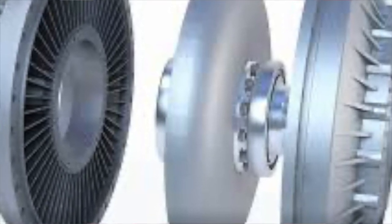And then what happens is as the motor picks up, the two halves turn independently of each other internally. As the motor picks up its RPM, those fingers try to take that fluid and sling it to the outside. Well, the channels get bigger to the outside as they go because they're shaped like a pie. So they get bigger to the outside as they go, and what happens is that creates hydraulic force further out. And that force has to go somewhere, so it goes back into that gap in the center. But the gap is extremely tight all the way around. So that force doesn't really have anywhere to go. So it ends up hitting the other side. And then as the two fingers pass each other, it creates a lot of tension, almost a hydraulic lock.